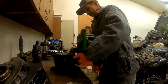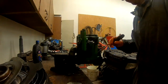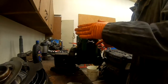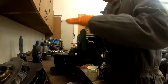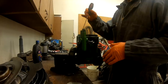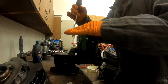The way this system works: when you start the tractor there's a spring called the bias spring. When the tractor is off and nothing is turning, that spring rocks the swash plate over to full stroke. This is a Rexroth pump. When you start the tractor, because of that bias spring, the swash plate is at full stroke. Once you start turning and pushing some pressure oil out the discharge port, it feeds the priority block and goes to the inlet priority valve.